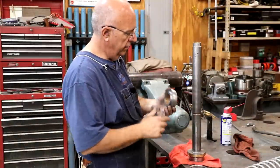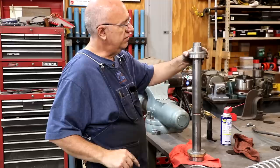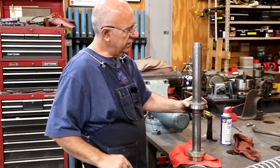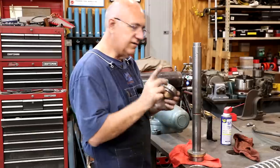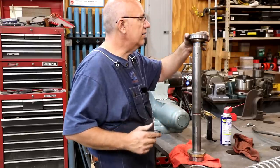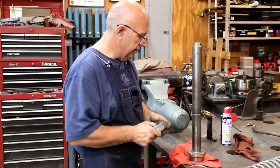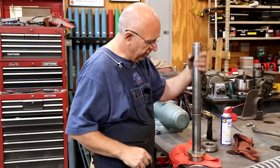I'm over here looking at the piece that holds the spring in — it has the bronze bushing that guides up and down on this shaft. I think I'm going to leave it alone. Talking about the tolerances, this is just a guide and it needs to have some flex; it doesn't need to be super tight, and it's in spec. So I think we're just going to leave it alone rather than trying to replace it — save a little bit of time and money. I'm happy with how this shaft turned out. We've got it cleaned up good.